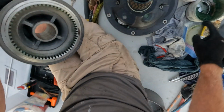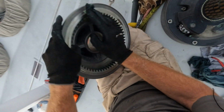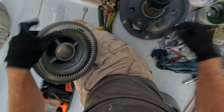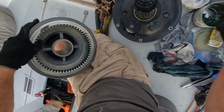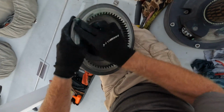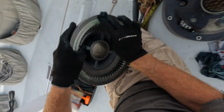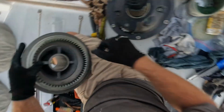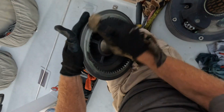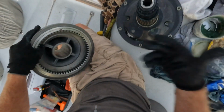And see where there's corrosion in the edge of this ring? Why let it develop? Now, is it going to catch dust like this? Boats are not very dusty environments. It's not really an issue. Is it going to repel salt? Yes, it is. That's what we want, right? We don't want salt and water getting in here because this is stainless steel and then this alloy. Get it in. Get it out. Hopefully we got ourselves a bit of protection now.